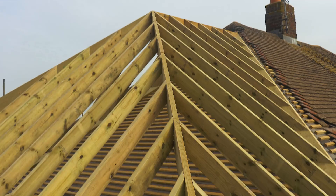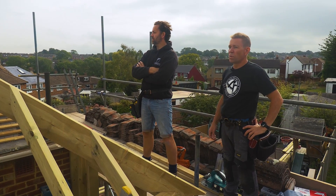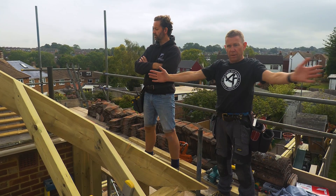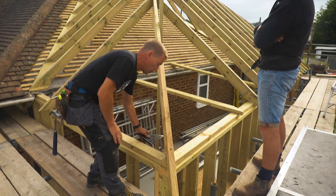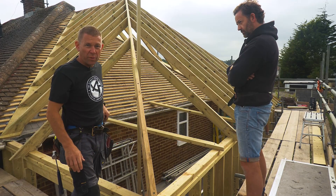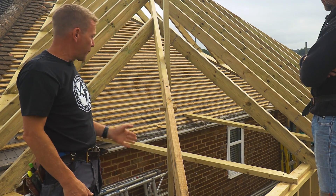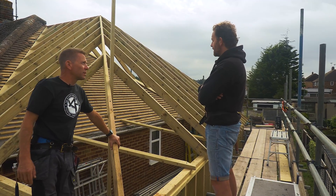Right, I think we're done. Round the front now — that's my neck now. There we go, that's another end done so it's all complete. The front's exactly the same — it's out of square. This is 83 degrees, a 7 degree difference under. So all the cuts we're cutting at 43 and a half degrees, and out the back 48 and a half. Same principle — measure them, lay the saw over at 43 and a half, then 38 degree plumb cut. We cracked it — good to get underway.